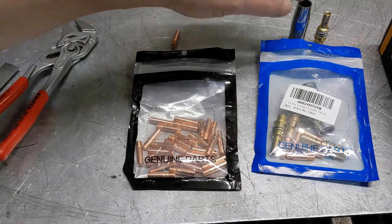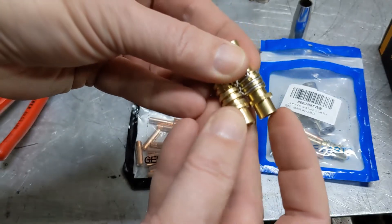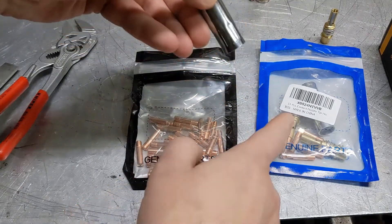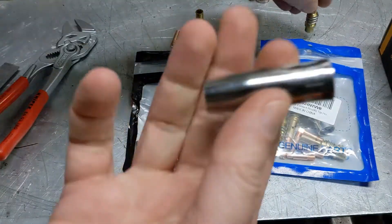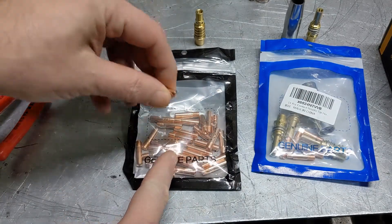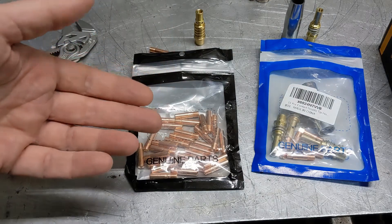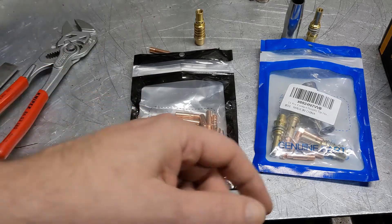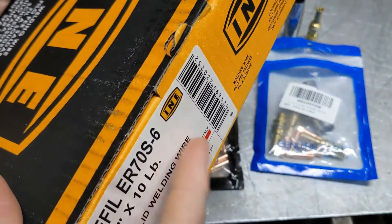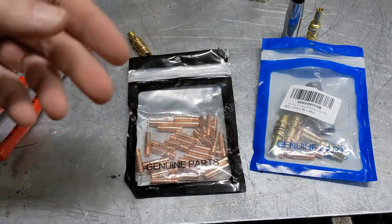I ordered these off of Amazon. Here's the old one here, and this is the new one. They're shaped a little bit different, but they are about the same length. And importantly, it looks like the thread here is the same, so that should work out. It was four of these tip holders and then two cups. While I was at it, I bought a bunch of nozzles as well. A bunch of these 035 tips. The whole reason this happened was because the heat was set too high — somebody was trying to weld something way too thick for 023 wire. So I've got some 035 or 1mm tips and 10 pounds of 035 wire. I'm going to put this wire in, take that 023 out and set it to the side for when I'm doing sheet metal, put in one of these new tips, get it back together and make sure everything works.